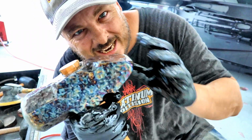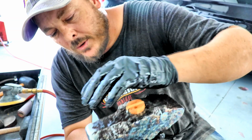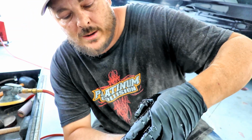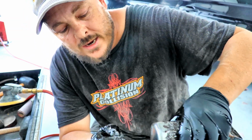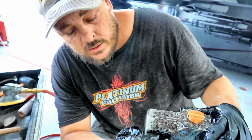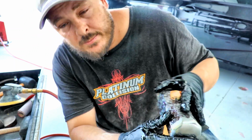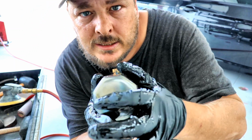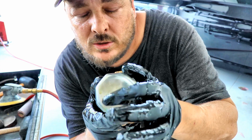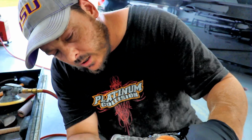So I'm gonna put this thing to the test on Saturday. And we're gonna see if we can beat the crap out of it. It's pretty soft, I can tell you that. From when I was grinding on it, and then after I ground it, I tapped it a couple times with another hammer that I know is pretty hard. The peening hammers tend to be pretty tough, so I tapped it with a peening hammer, and it did leave just a tiny little score in the face of this and did nothing to the peening hammer.